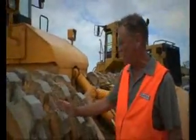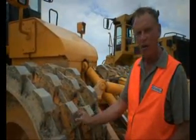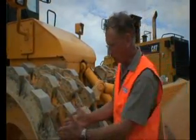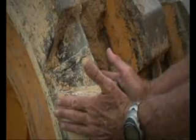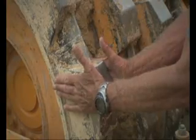You can see here in the drum we have only four rows of feet against five narrow feet on the original. Also you can see the taper to the base so that the drag is only where the compaction is happening. Freedom of movement there.